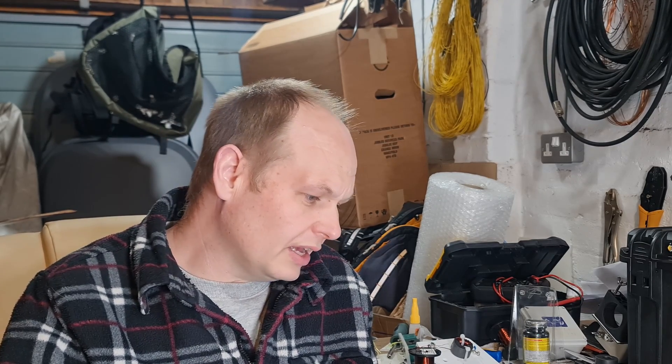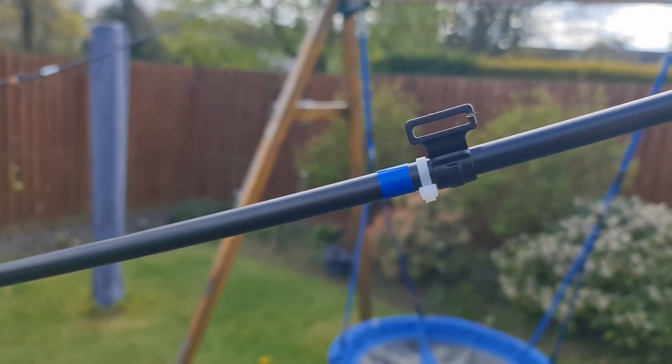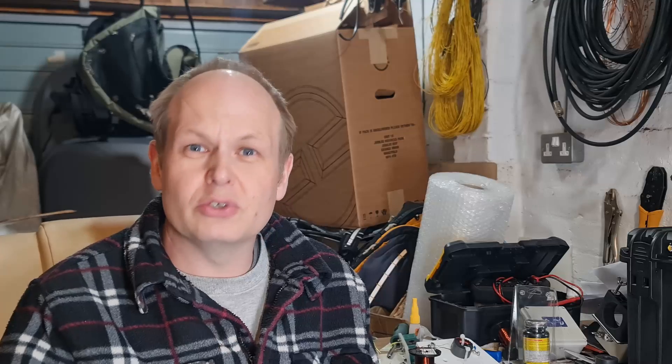You have to attach your coax or choke connection at the 20 metre element — a lot of them come over the top, but I've decided to use the bolts that go through the hydraulic clamps through the centre post itself, and they're actually working great. On the spreaders I've put some colour coding for my benefit, as I've been taking loads of notes. I'd advise anyone building a hex beam: take notes, then more notes, backed up by pictures, so you can jog your memory later.